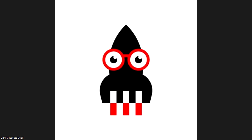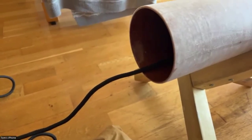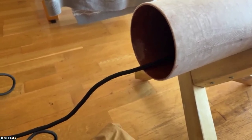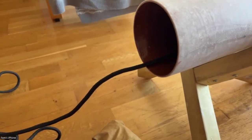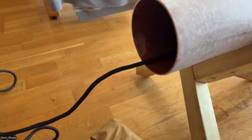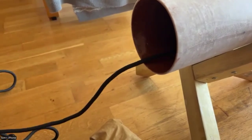Well, depending on the airframe, you also risk damaging the cord too. That can be a pretty abrasive surface. So, worst case, you put a pretty good wad of duct tape right there where it hits. As I said, we were considering using EPDM tubing, just kind of rubber tubing, to increase the surface and also give it a little bit of flexibility and padding on contact, and just securing that in place with some duct tape and another knot potentially.